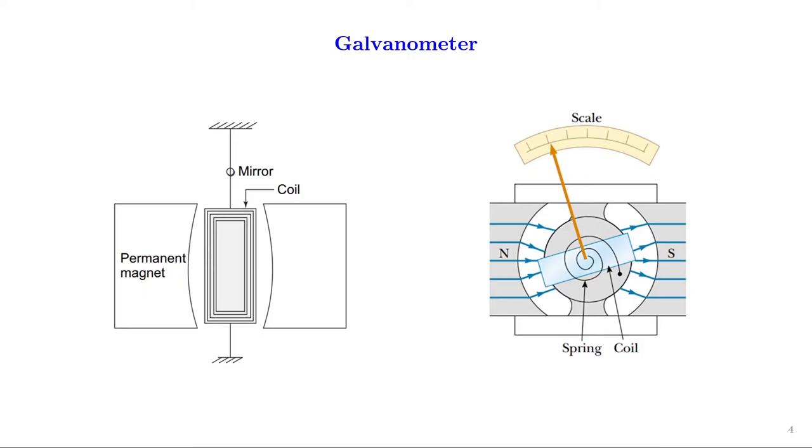The main components of a galvanometer are shown in this figure. It consists of a coil of wire placed between the pole pieces of a permanent magnet. The permanent magnet has concave pole pieces so that the magnetic field will always be radial to the surface of the coil. This coil is suspended in the magnetic field using a light inextensible string. When we pass a current through the coil, the coil experiences a torque due to the Lorentz force and it deflects.